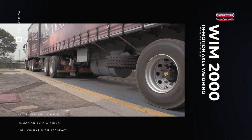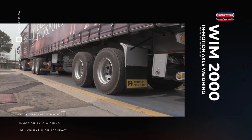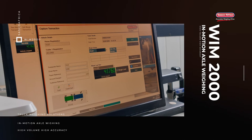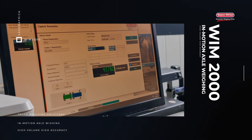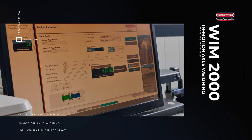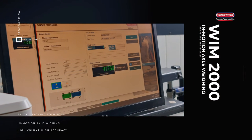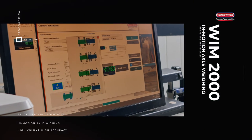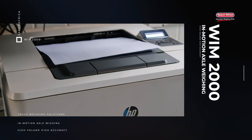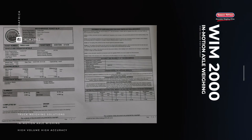Sassco's ProWay Plus software will now create a weigh-in transaction containing all the legally required particulars. If the Sassco business connector module within ProWay Plus is activated, the complete weigh-in transaction details will be sent electronically to a designated ERP system, and a physical weigh-in ticket will also be printed for the truck driver. The weigh-in ticket is in a format compliant with the requirements of the Road Traffic Act, and has on it the owner's particulars, the registration details of the horse and trailer, the axle weights and total weight, plus the permissible axle weights and total weight.